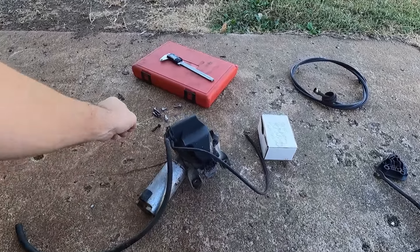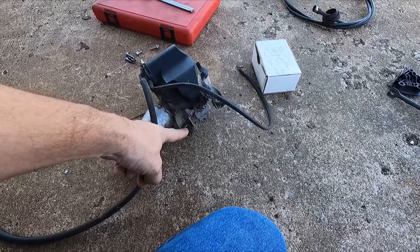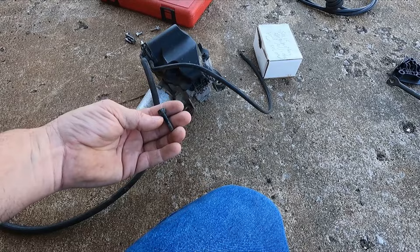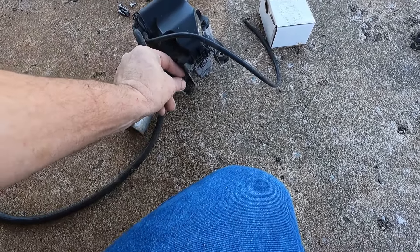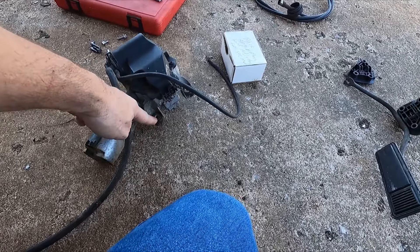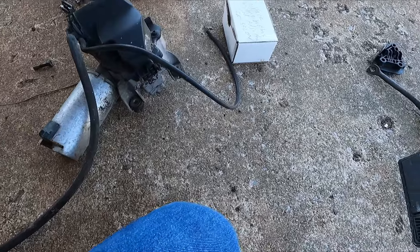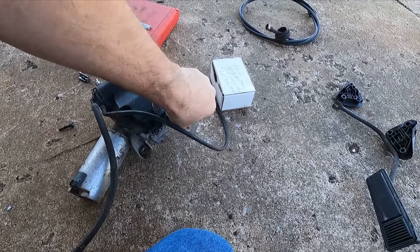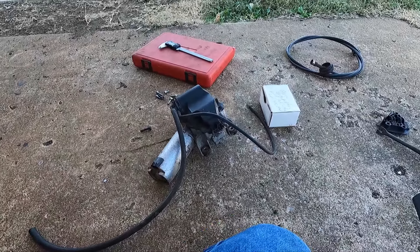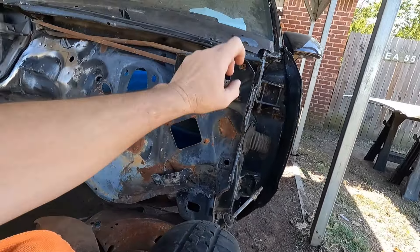That's a pretty unique little part for a g-body using the V6 stuff. I'll have to put a special pivot on the carburetor linkage - I have that, so I'm not too worried about it. Now this is the wiper motor here, and what I was trying to do was figure out how to make it take 12-point ARP bolts. It's got a countersink in it with sleeves - almost like a washer with a sleeve - but the bolt itself is pretty sloppy inside there. I think I'm going to change this to quarter-inch, drill it and tap it to take a quarter-inch bolt, so it takes the slack out and fits tighter in the factory sleeve. The ones I dug out from my ARP 12-point box are too short - I need some a little bit longer.